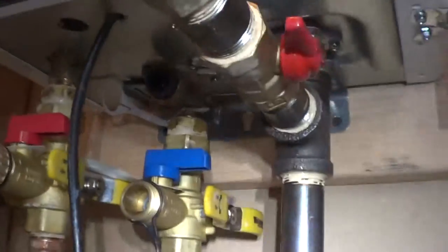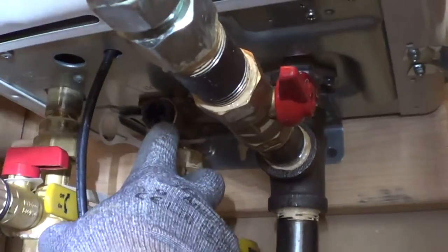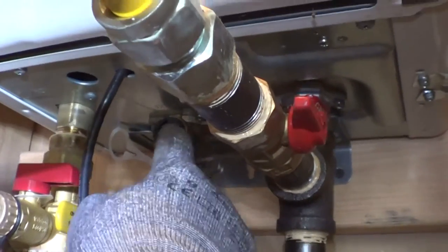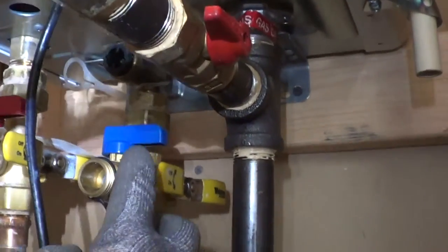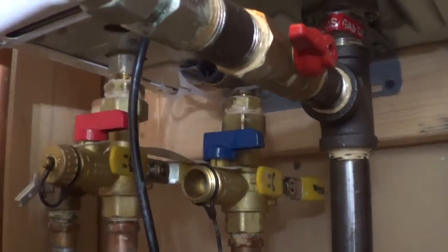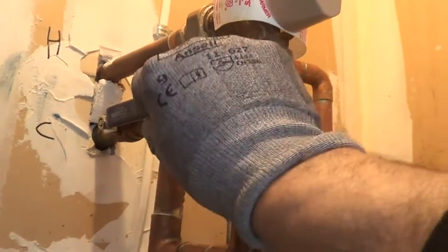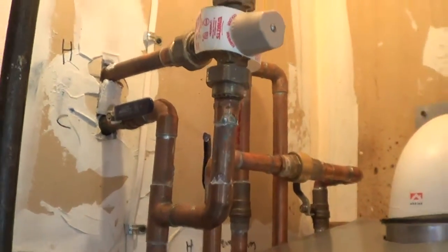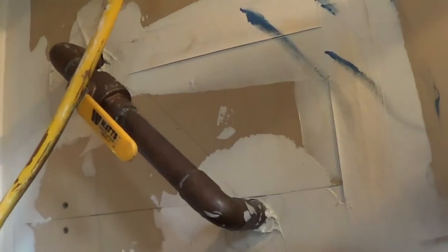It's important that you check that you had your valves off. And by the way, if you had an emergency where you had the valve on and your strainer started blowing water out because you didn't turn off the water, all these condos have a main shutoff. On the installations, you just shut off your cold coming in. Your main water shutoff is right on the other side. Whenever the handle is 90 degrees, that's when it's shut off.